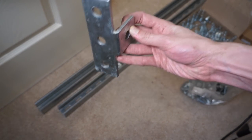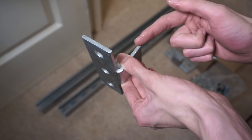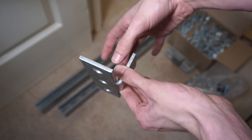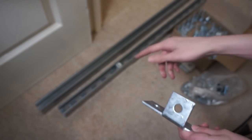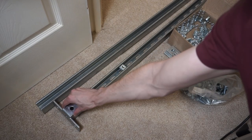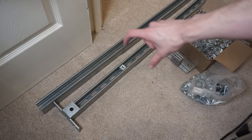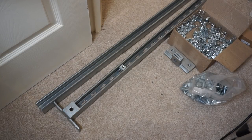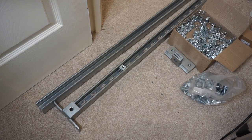And what I'll be doing is mounting these into that wall on the side. So the wall will be here and that'll be screwed into the stud. This will stick out and I can then hook the channel in behind it and screw the channel in. So what will ultimately happen is I'll have a Zebedee nut in the corner here, and then I'll be mounting that over it like that, screwing through into the Zebedee nut, and that'll be screwed onto the wall. And I'll just have two lengths of this channel going across the wall, and then I'll mount the cabinet into four of these Zebedee nuts mounted wherever the cabinet's going to go.